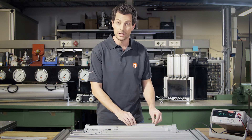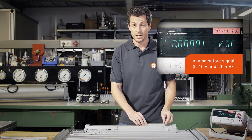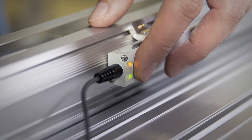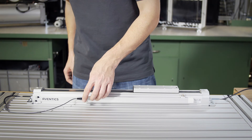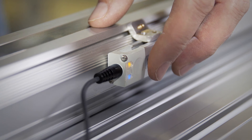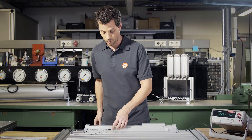Let's see if we've done everything correctly. By the way, the analog value output can be switched from voltage to current. Briefly tap the control panel, then touch longer until the second LED flashes. Now we can tap quickly to switch back and forth. Green flashing stands for voltage, blue for current. To save the settings, simply press a bit longer once more.